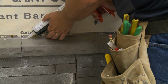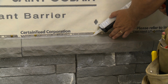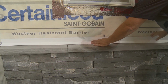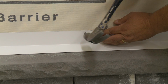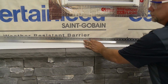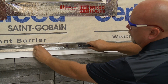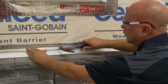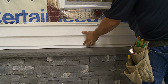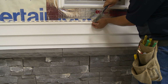Vinyl must be treated just like any other material when it comes in contact with brick or stone. This means it must be installed over flashing to assure a watertight joint. When installing vinyl siding over brick, stone, or any other such material, install adequate flashing to prevent water intrusion. Then, proceed with siding installation using a starter strip or J-channel installed over the flashing.